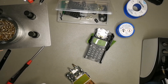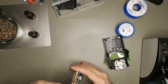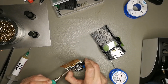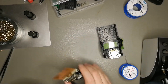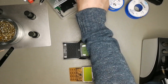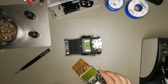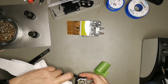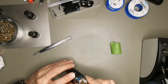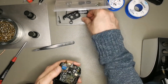The RF board where you do the RF adjustments has to go back in now. Put it back on and solder that one ground pin back onto the PCB and clean again. Now we are almost there: put the key mat back in, put the conductive rubber pieces for the speaker back in, the PTT PCB, clean the display from fingerprints and also the inside of the front housing from any dust, then wiggle it back in. Put that plastic piece under the keypad, screw it in — don't over-tighten the plastic screws.